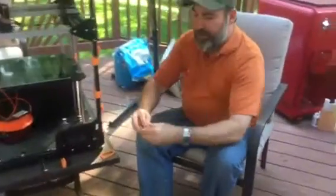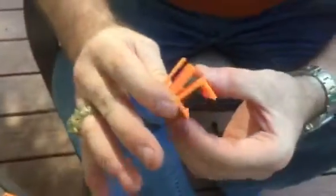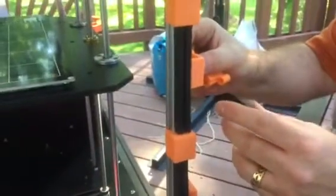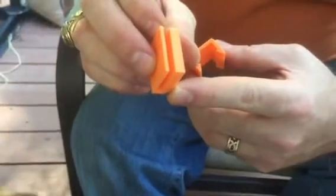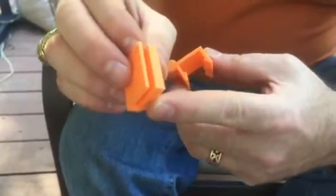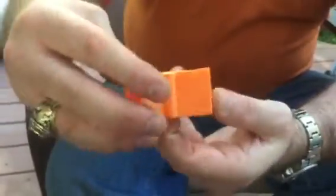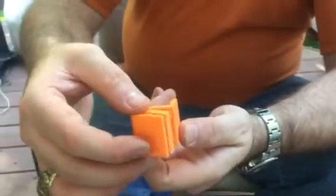Let me show you some of the pieces — I'm going to put these parts on Thingiverse for everyone, so if you want to try this, you're welcome to. The first thing I built was a set of hinges. This part of the hinge actually snaps right into the 2020 aluminum, and this piece wedges onto either a piece of foam core — I'm using corrugated plastic — or acrylic or plexiglass, anything that's about a quarter inch or seven millimeters. That gives you the ability to hang a piece of board off the front, back, or side of the machine, and you can have a door.